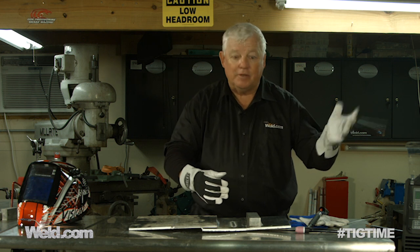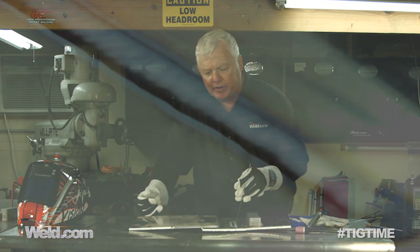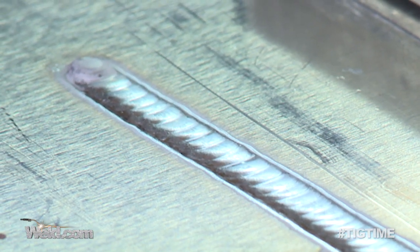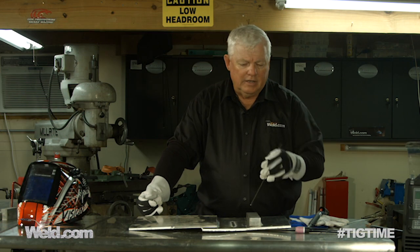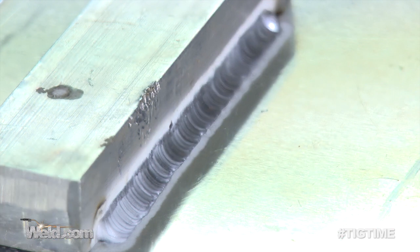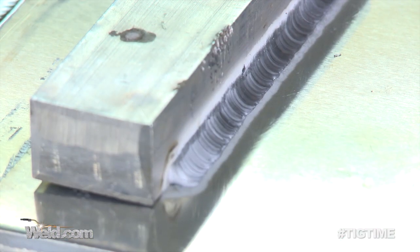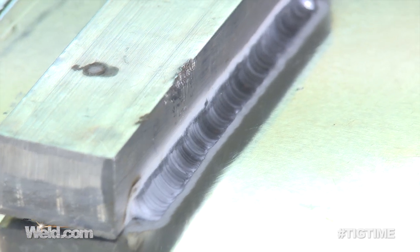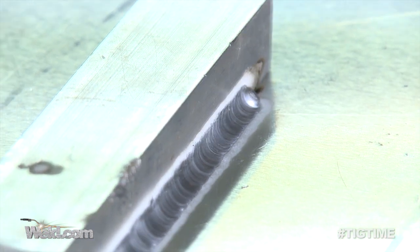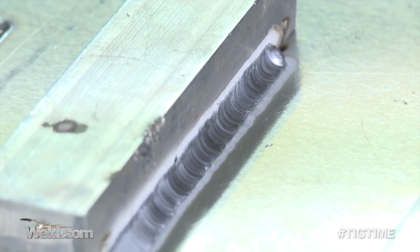I'm on 70% negative, so I'm looking at the edge of the weld to see if it's cleaning too much and whether the settings match what I like on other machines. Then I took a cold piece of inch and a half thick aluminum bar — the oxides are pretty heavy on it, so I wanted to let the machine do the work without pre-cleaning the part. I started to weld and it didn't have enough amperage, so I turned it up to over 300 amps and made the weld — about a six inch weld. It took a couple of minutes but the machine performed just absolutely excellent.